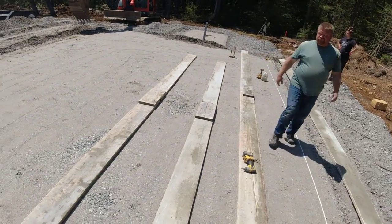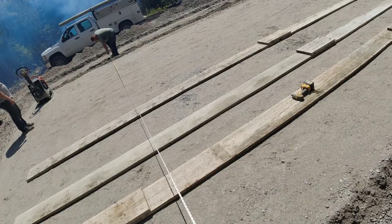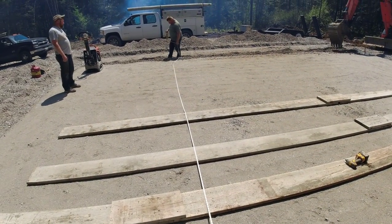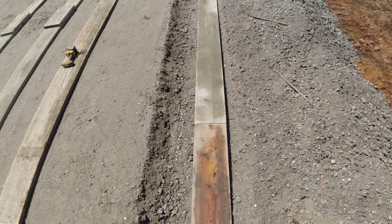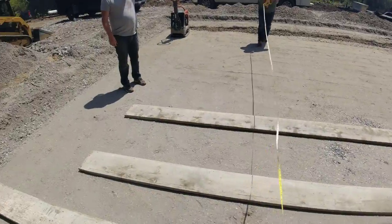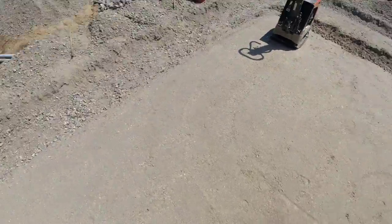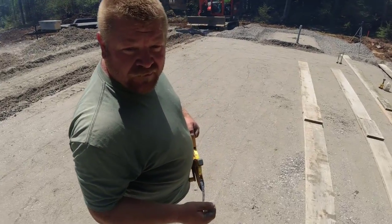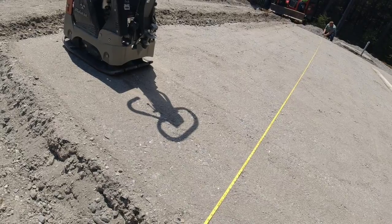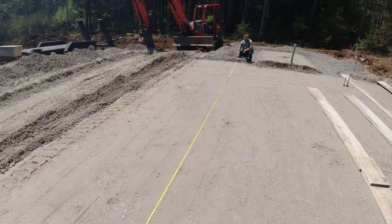In Maine, this is basically just a haunch slab - we do a ton of these. The edges are thickened to 12 inches but the slab rolls up to six inches on the flat part. Today, we roll in, get our forms off, get them all screwed together, and put them in place. But the outside edges of the haunches are the exact same width as the slab needs to be, so there's no room to put our forms in - the forms are going to hit the dirt on the outside. The outside edges really should be dug at least a foot wider all the way around than the slab, so if it's 44 by 28, you want it dug out 46 by 30 - a foot on the outside and up to two feet on the inside of the slab.